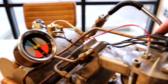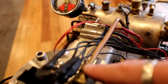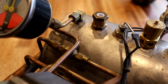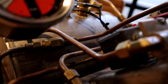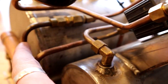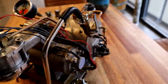That's just a way to vent the excess pressure out of your portafilter so it doesn't spit on you when you open it. The final thing going into the drain manifold is an expansion outlet — as the water heats up in the brew group it expands, and the excess pressure comes through this tube and then through what is basically a pressure relief valve set to some pressure above your brew pressure. In this case it's probably set to around 12 bar, so if any pressure on the upstream side goes over 12 bar it'll automatically dump through the valve into the drain manifold.